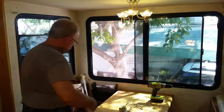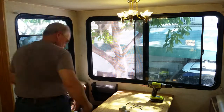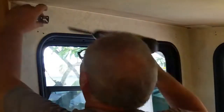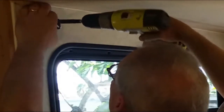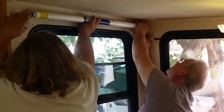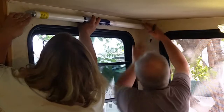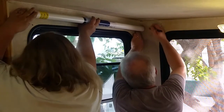With the wall cleared of all the old hardware, I could mount the new window shades. There are different styles of mounting hardware for window shades. I use the ones that can be used on the wall, ceiling, or inside a casement — this gives me the most flexibility on how I could mount the window shades. I used the original screws that I took out because they are still in good condition. Make sure you're tall enough to reach; I had to use my step stool to get up the side. Having some help in hanging the shade makes for fewer mistakes and even fewer discussions later on why something is not working or is not straight.